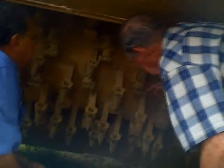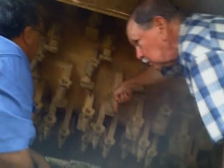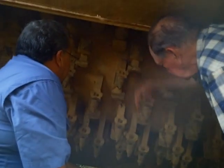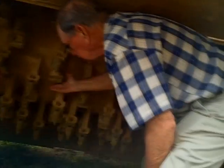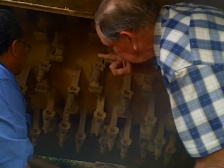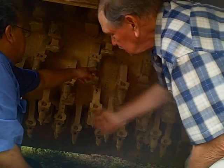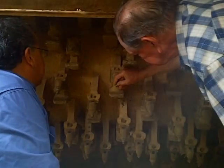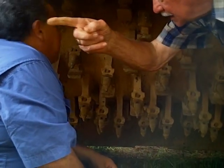Here, the points are open at an angle of 135 degrees, and they're put in so that they're not straight — they're off one degree, so that when they go in the dirt they'll turn. These paddles help to mix it. As he's going forward, this rotor is turning this way, cutting up. That's carbide — that's how they can grind that road up out there.